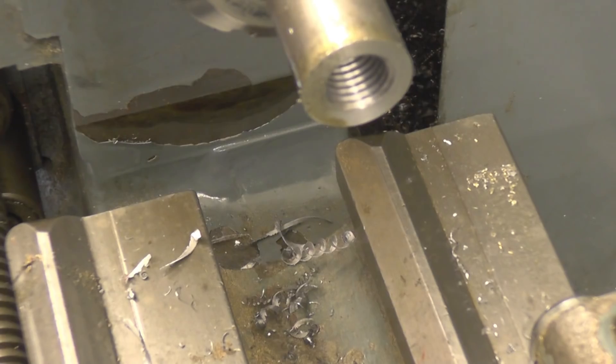That's basically all I use the chuck for. It lives in the tail stock of the lathe for drilling, and especially for holding fairly large taps, because it can transmit a lot more torque than an ordinary drill chuck will.